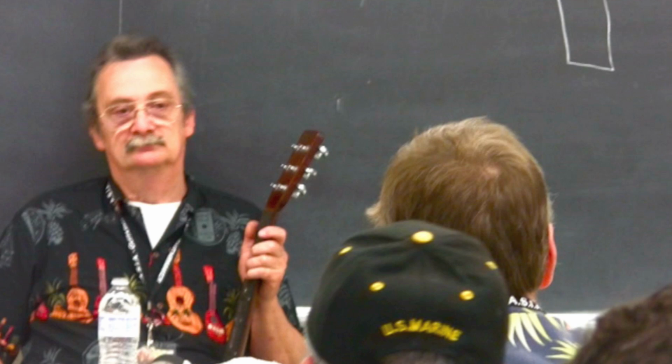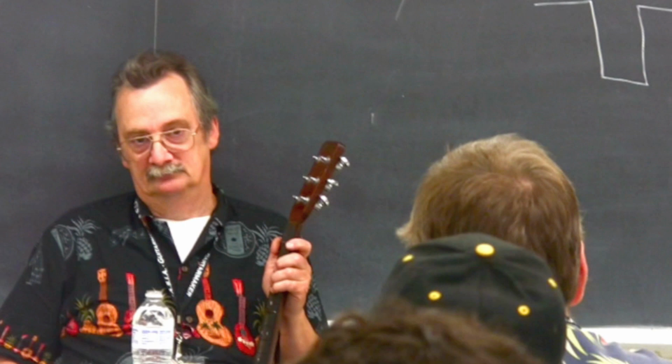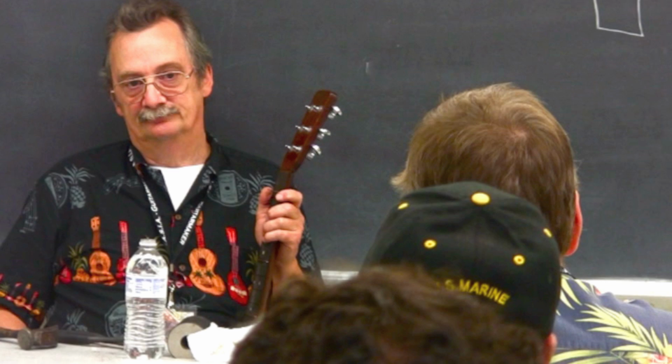What I find, John, that I do in situations like that is I'll just refret 2 to 10. Mm-hmm. I'll pound those frets in. I won't trim them, I won't do anything to them. Get the frets in, string the guitar up, and then do all my measuring. Did I nail it? No, there's too much forward bow, too much back bow, deal with it. Pull those frets out, put the right ones in. Once I've got the neck where I want it to be, under tension, then I'll trim those ends and do the first 2 frets and the remaining. Yeah. Saves me from going through all the dressing and all that process, only to find out I'm wrong. Yeah, because I'll nip them off. I agree with you. I don't bother doing the final end dressing until I'm done.